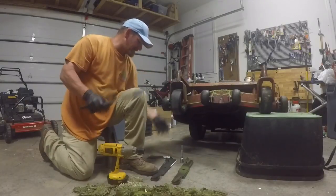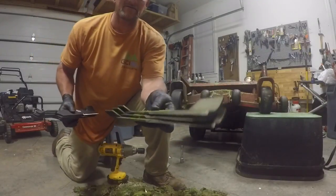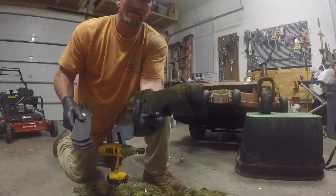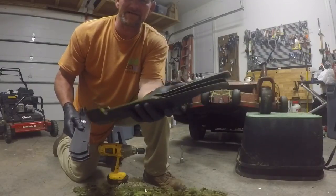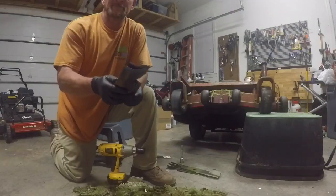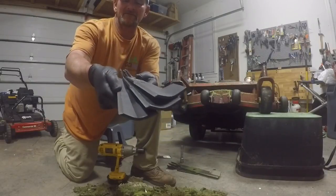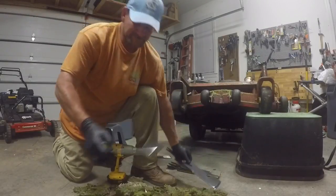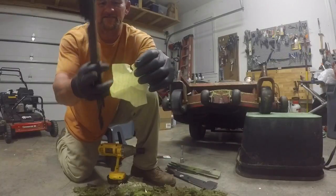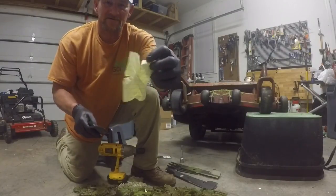The way I go about changing mine — I have two sets of blades. This is the set that just came off, and you can see they are in rough shape after about 25 mowings: all jagged and beat up. That's just not a good blade to have on your mower. And this is a brand new blade that I've run through the Magnematic to take the paint off and put a good edge on it. It's quite sharp — watch it cut this paper. You can see how cleanly it cuts, and that's pretty good for a lawnmower blade.